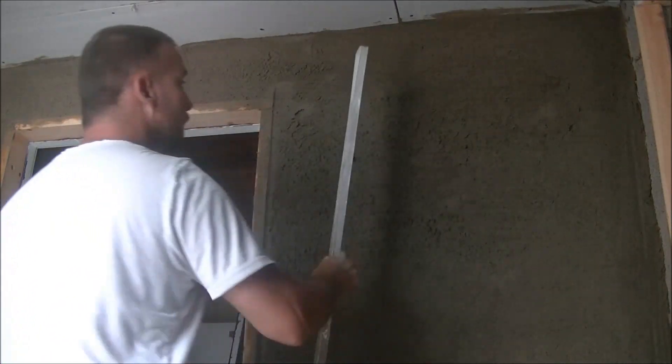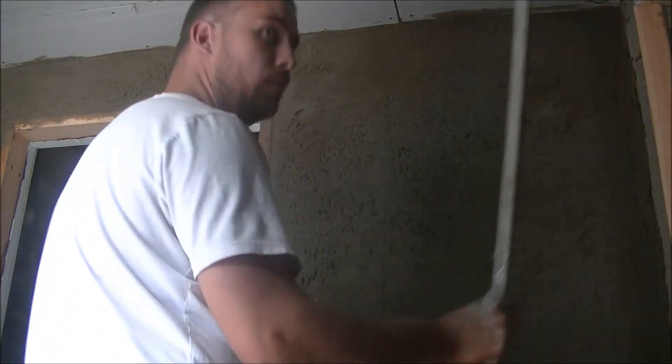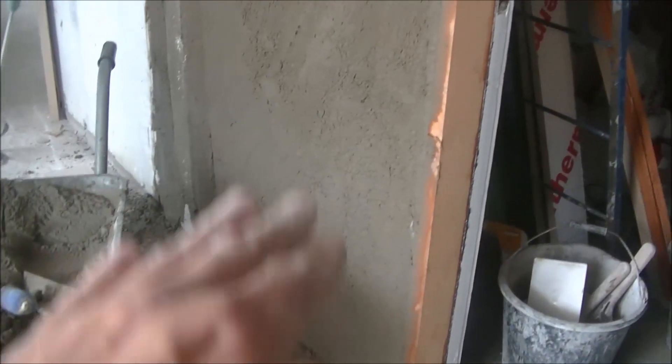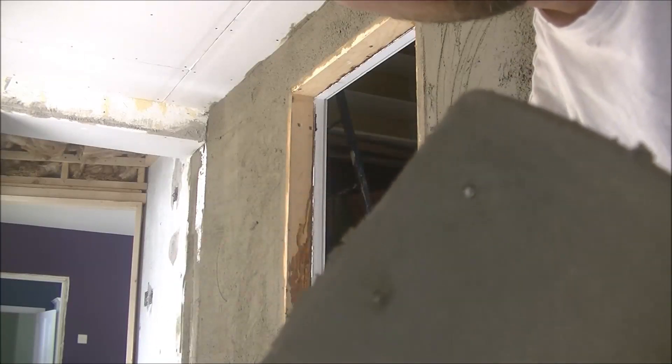As you can see, I've just cut that door frame back a little bit and I'm running my eye up and down it as I bring the edge to me. I'm going to pull my edge down on this and then come across again and come up and down again — just double-checking everything quickly, making sure it's all nice and straight before I start rubbing up. Pull it towards you, keep a good look at it, and check the skirting angle.